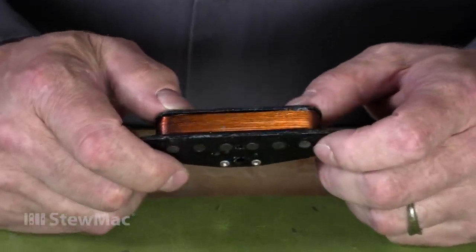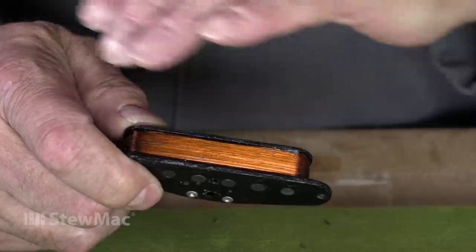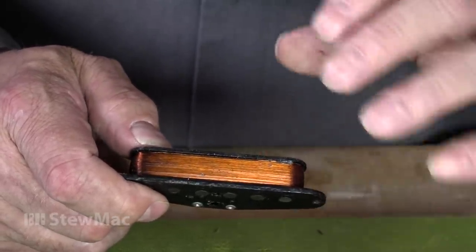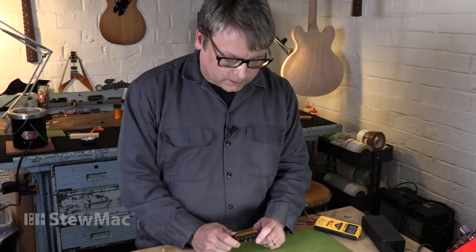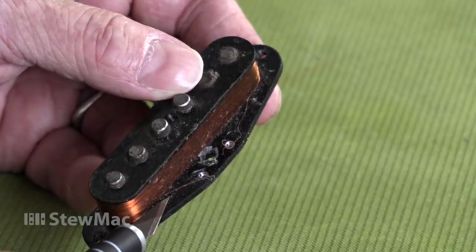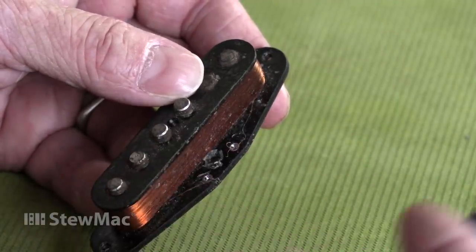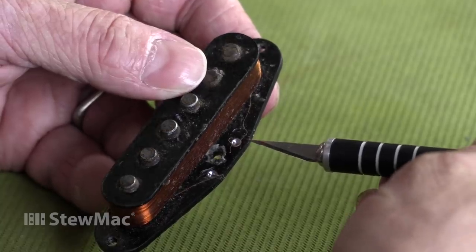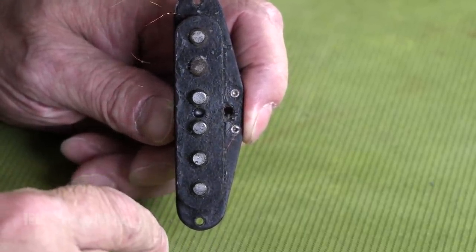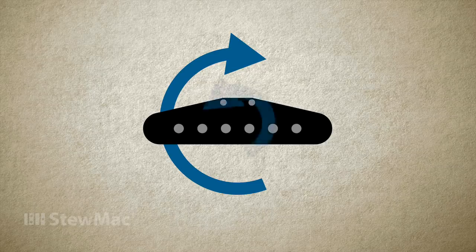In most cases a dead pickup has a short in the wire and it's no longer making a connection or making sound. That's not the case here — it is making a sound. Over the years, the insulation on the coil wire has developed little cracks and flakes inside the coil that have caused it to short out on itself. So I'm going to go ahead and cut this wire off the bobbin. Before you go cutting wire off, you want to pay attention to the winding direction. The start wrap is buried pretty deep in the coil and the finish wrap is running on the outside. This pickup was wound clockwise around the bobbin, which tells us we're going to have to run the winder counterclockwise.